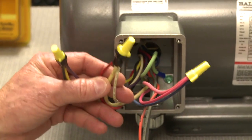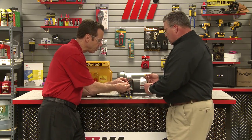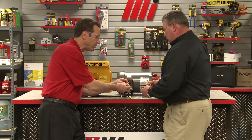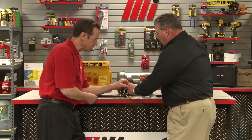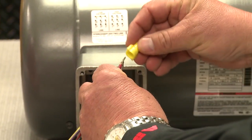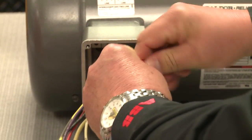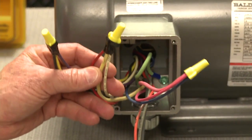We've already done three — you can see they're finished here — but we have three other wire leads right here and they look clean and ready to go. What we do is take those three leads, collapse them together, tie them off with a wire nut, and then finish them by utilizing good electrical tape. Once the wires are connected, double-check them. Make sure that we follow the wiring diagram that's on the side of the motor.